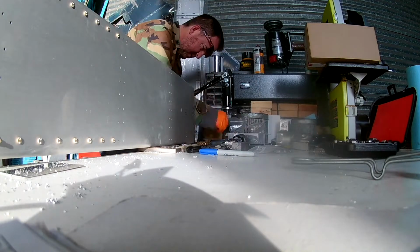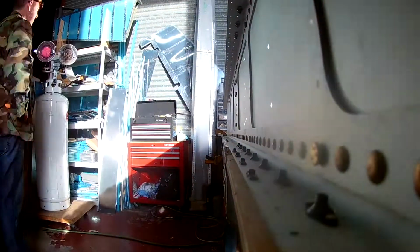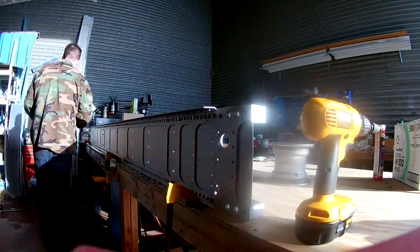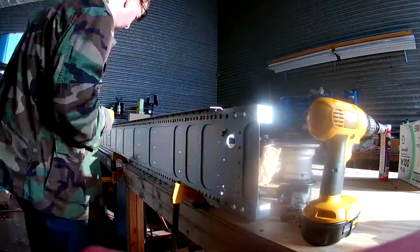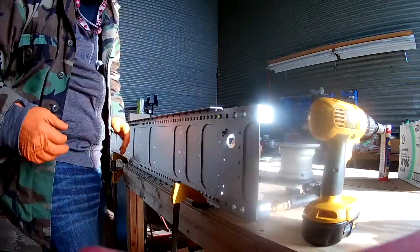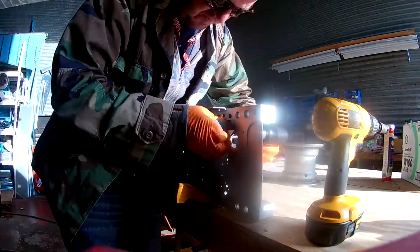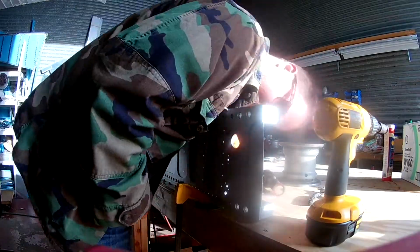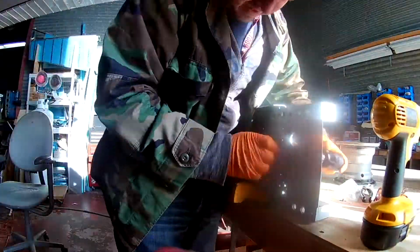Most of these you have to do with a rivet gun. You can do the outer two with a squeezer, but the inner two you need a rivet gun for. They're pretty thick, size 3 rivets, and pretty big. I think they're six length. I don't care how well the holes are lined up, with really long rivets you've got to be very delicate. So that's when I turn the pressure on my rivet gun down so that I don't wind up smearing anything.